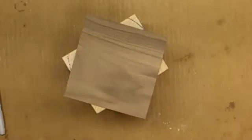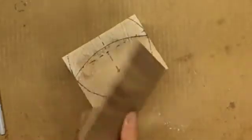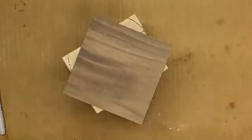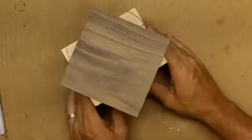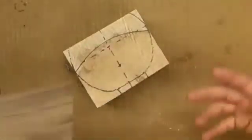They sell a 1/10 of an inch and a 1/16 of an inch. So if you wanted to buy the wood, you could go on their website and buy some 1/16 or 1/10 inch thick non-paper backed veneer. And the beautiful thing is that because we're just using the edges of it, we're not so concerned about the figure. If you're buying highly figured wood from them, it can get kind of pricey. But if you're buying walnut in a 1/16, you're talking about 75 cents a square foot, because all we need is the plane. And so it's really affordable, and it's a pretty easy way to go. So there's an option for you. Or you can just take thinner veneers that you buy in any store and stack them. So there's lots of ways to make this work. All right, so let me show you the microwave technique.